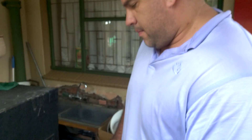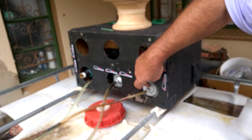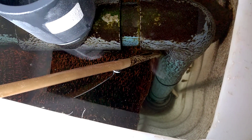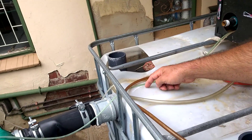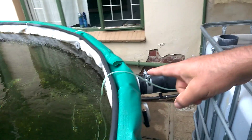The water comes in here from the dam, and on the other side at the bottom you can see this blue pipe — this is an air lift. I've got two air pumps or blower pumps. Air comes down a hose right into the bottom of what I'd call an injector nozzle, where there are hundreds of holes in the blue pipe. This brings the water and air up to the top, where I get rid of the air, and the water goes to a T-junction. On the other side there's another air pump exactly the same way, and the two come together as your inflow back into the dam.